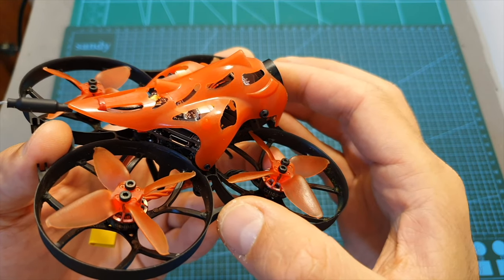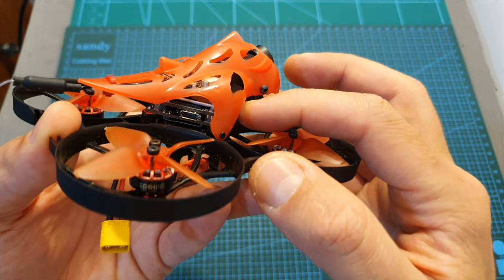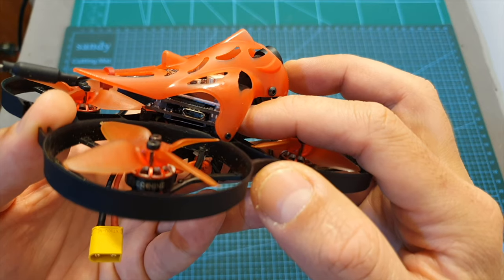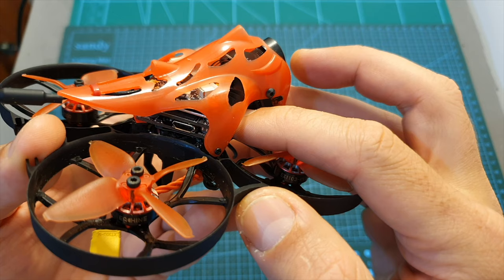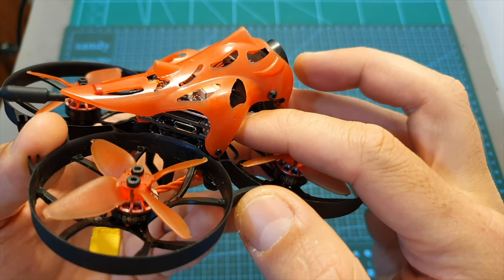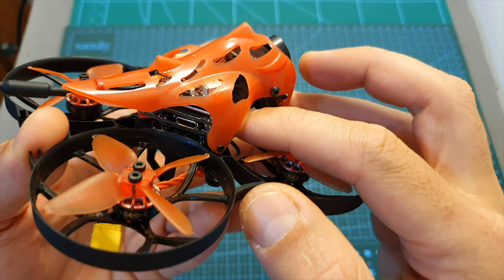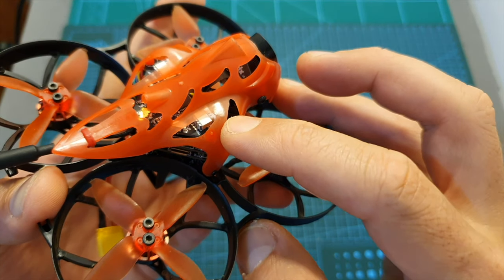The bind and fly version is available with either Frsky or Flysky compatible receivers, which are built into the flight controller. In order to bind them, you will need to use the SPI-RX bind command, since the bind button is pretty much blocked with the Caddx Tarsier board. You should note that the range of these receivers is very limited, and you can expect between 100 to 150 meters. In addition, you can also get another bind and fly version, which is bundled with a TBS crossfire receiver, and then you are going to be pretty much limited by the range of the VTX.